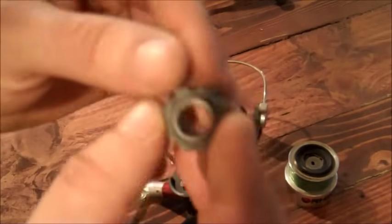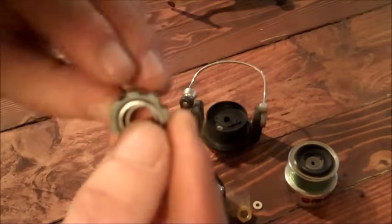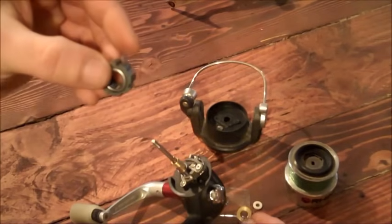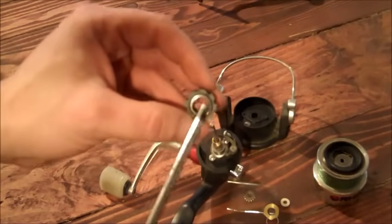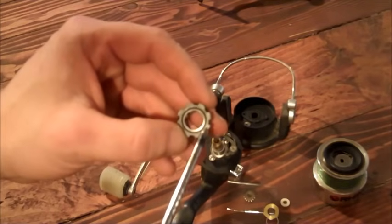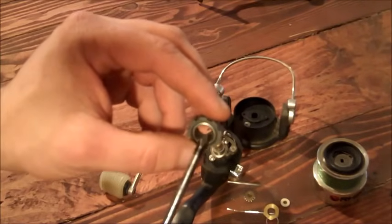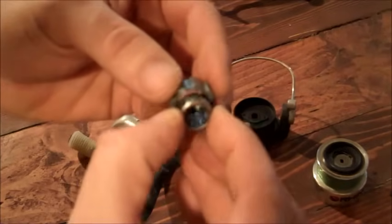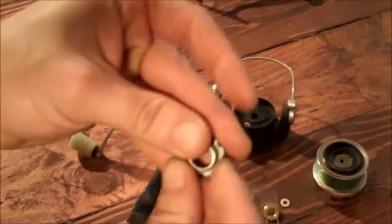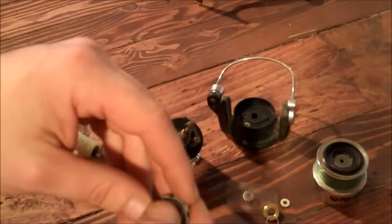So this is our issue. It's this little latching gear, and inside of it, oh, there's another little O-ring I'm going to be careful of. So that's going to go on top. Got to remember where these pieces go. So this bushing inside of here, this brightly colored silver part, is slipping off of this toothed part. So what you want to do is take this out. Hopefully it comes out easy. Alright. So we're going to take this out, coat this with JB Weld, and slide it back in there and let it set for a few hours, really for 24 hours, and that'll do it.